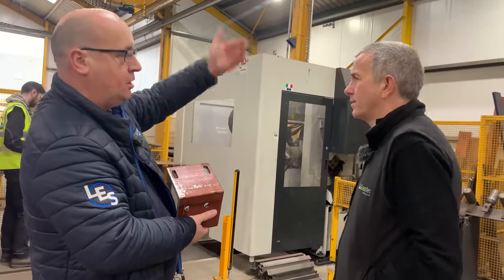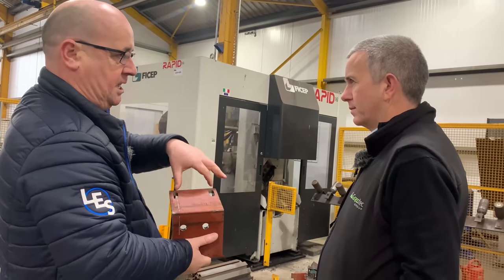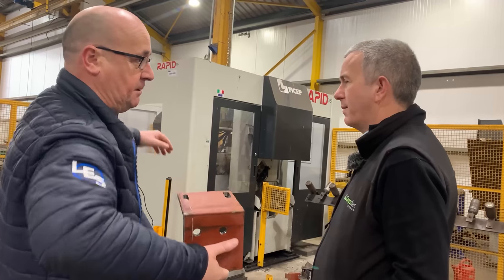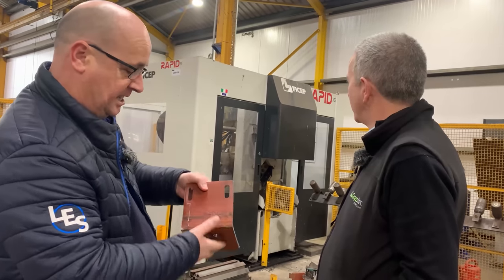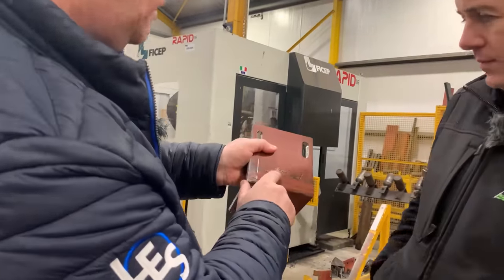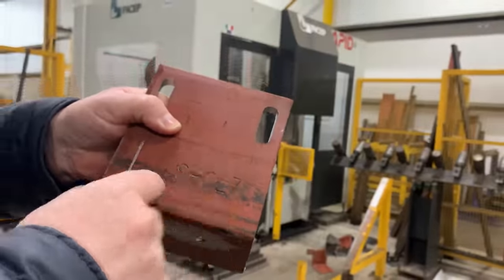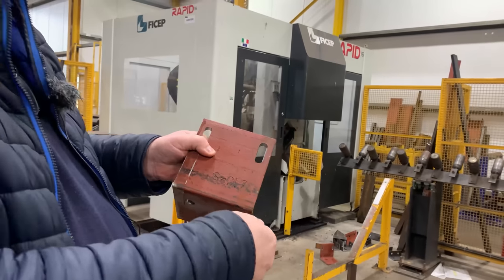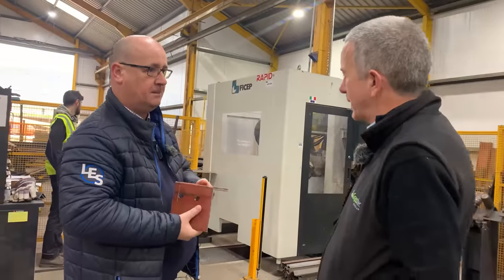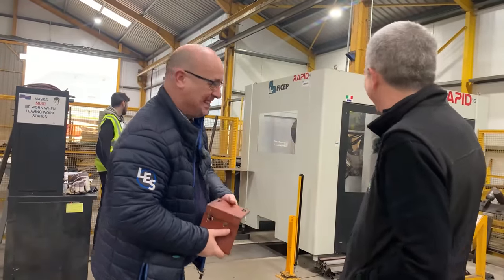In industrial and commercial buildings you could have a firewall, and in a firewall situation all the holes have to be slotted for expansion — if there was a fire inside the building, there has to be expansion. And if you remember on this piece, you had your numbers. That number now will match a drawing for the erectors, and they'll know where to put this piece. Great traceability. Traceability is the whole thing — in food and steel alike.